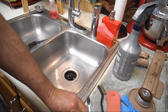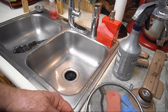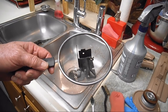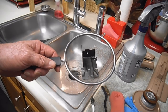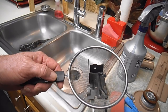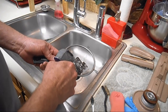And I'm going to take a look at these small parts now. When I have big groups of small parts, what I'll do is put them in a cheap strainer that I bought, and I group them by maybe the slide plate, needle plate, bobbin holder, a positioning spring, kind of everything around the bobbin area, and I'll do those. And then I'll do all the needle bar parts, and then all the presser bar parts and things like that. That way I don't get screws mixed up, and it's not that critical for me anymore, but I still keep them separate because it just saves me time.